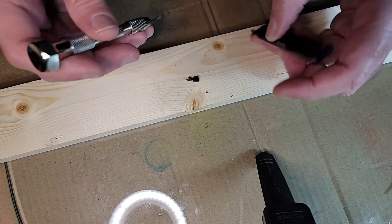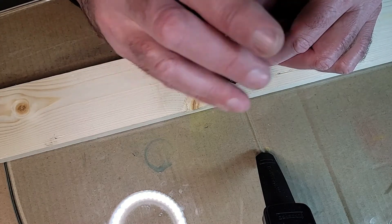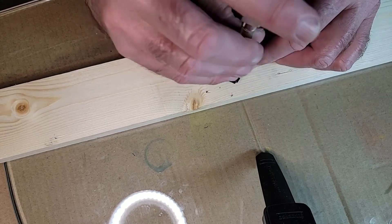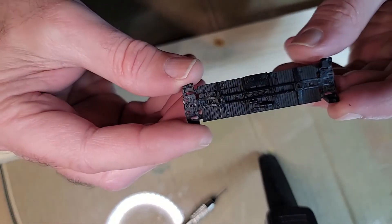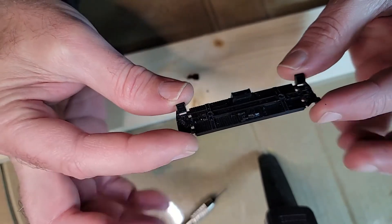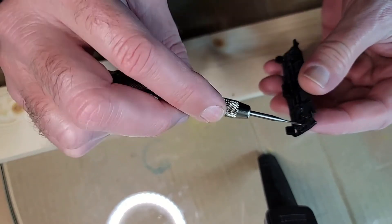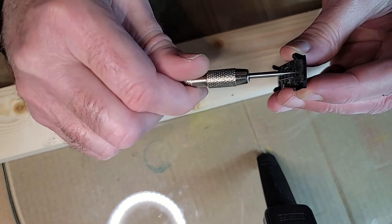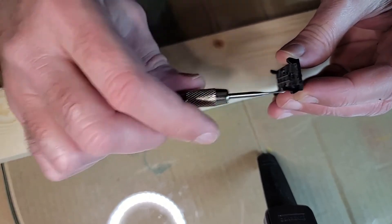I drilled one — let's see what I can do with this one. I don't know if this is going to show up very well in the video, but here we go. I'm doing this with the pin vise so I don't waller out the hole too big. I need to tap it just in case for that screw. I realize it's going into plastic, but for the sake of doing things right I'm going to tap it out. I've swapped out the drill bit for the tap — this is such thin plastic I'm not sure it's really going to do anything, but I'm going to tap it out anyway just for grins.